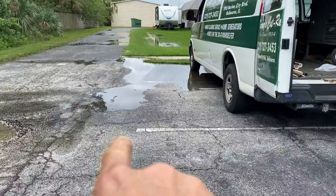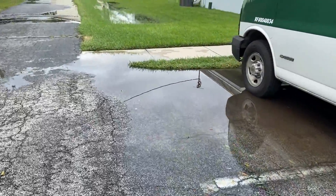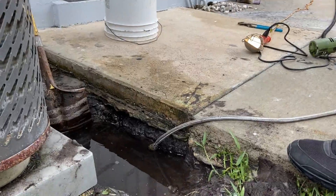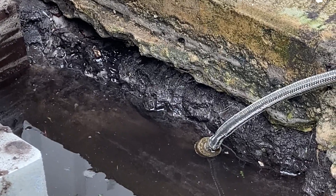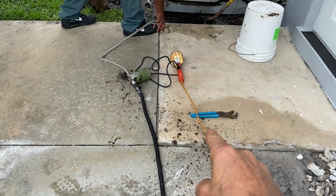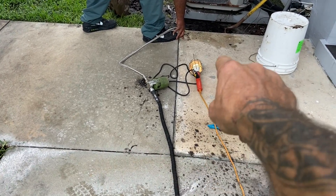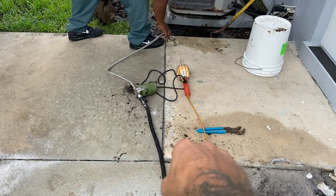As you can see there's water everywhere and my partner's up here and he's running a pump to try to suck the water out of the hole so we can dig. What we require is to take a concrete saw and cut about a four-foot section out of there, then break it all up with a jackhammer, find out where those water lines broke, and make the repair.